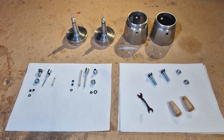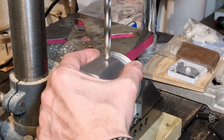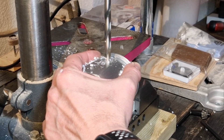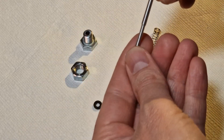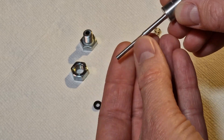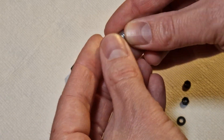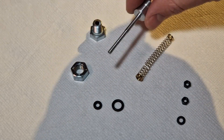I completed all the parts for the boiler including the safety valve. I drilled a hole through the other side of the pot because I wanted to keep the handle — it makes it easier to handle the whole thing when there's hot steam or hot water inside. The pieces for the safety valve are really simple; I only had to make two things: one is this aluminum stopper with a really thin threaded bit and a top part that seals, and a nut that I smoothed on top and drilled a hole through.